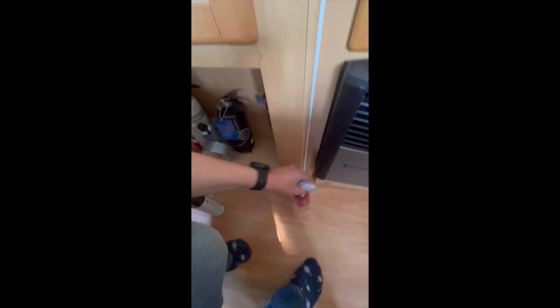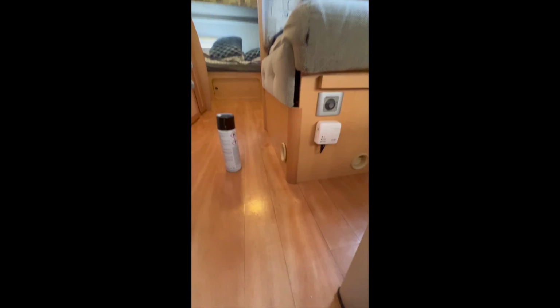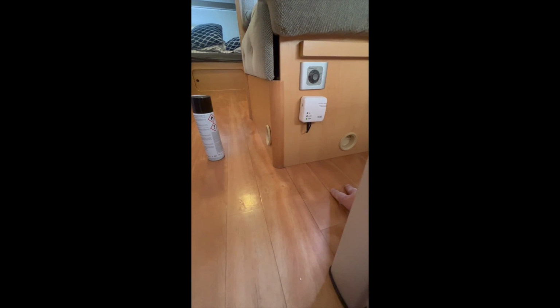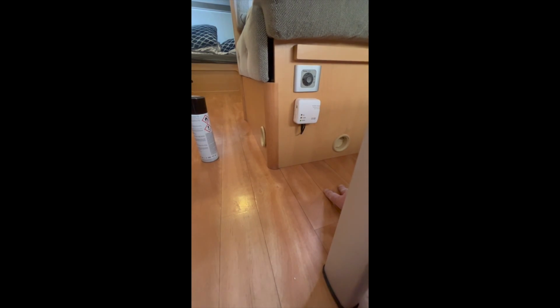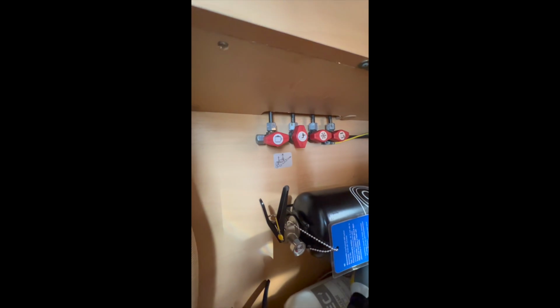So that's that. The next thing I will show you is the warm water. By default the warm water is off. And you can see here two things. This is the gas alarm for propane gas. It will automatically send an alarm when there is a gas leak, which is quite nice. And this is the thermostat for the warm water. Before using it, you obviously need to turn on the warm water gas opening, because it uses propane.